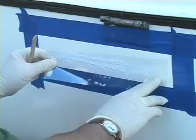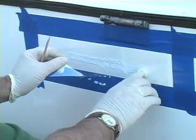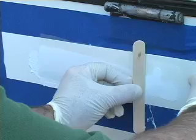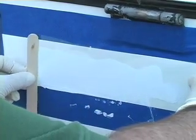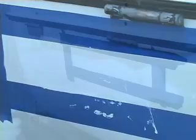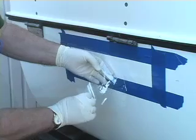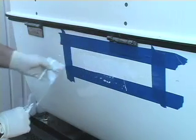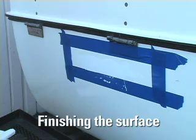The third method, which we will use here, is to use a flexible piece of plastic such as cellophane or mylar. Cut it to about the size of the repair, then press it down over the fresh Gelcoat. This will eliminate any air near the surface. The plastic can be peeled off after the Gelcoat cures. Our repair has cured and we are ready for step 3, finishing.